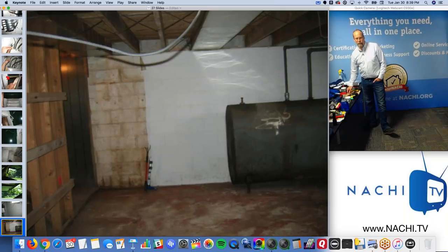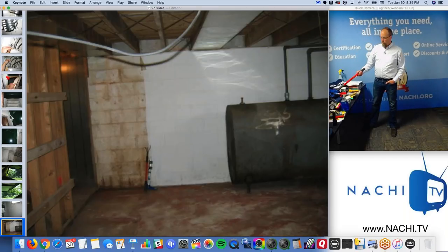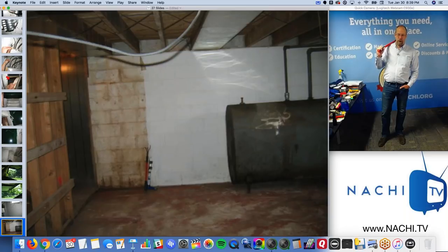So the left side of the foundation wall, obviously, they should have painted it. But you can see that there's actually water streaks and mud streaks coming through at the bottom row of concrete blocks. A lot of those problems with water intrusion start on the outside. And remember, we didn't have any gutters on the top roof, and the bottom gutter was filled with debris.